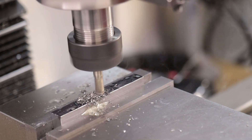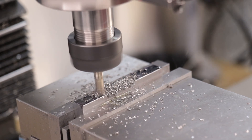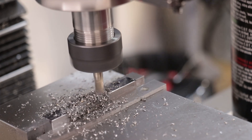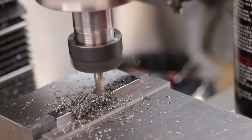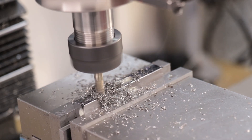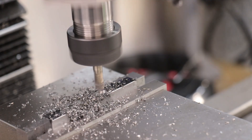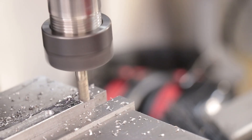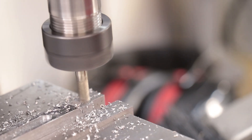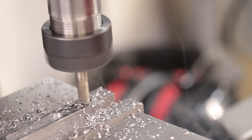What I will do the same though is machine a small slot in the tool holder to prevent the tool from flying out if the grub screws ever become loose. I've been using vertical mills for about 8 years now and there's still something about fly cutters that still freaks me out just a little bit. And at the same time I'll mill the cutout for the insert. For a small fly cutter like this, only supporting one face of the insert should be good enough.